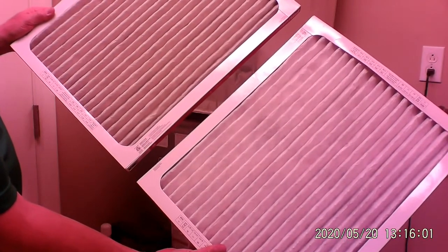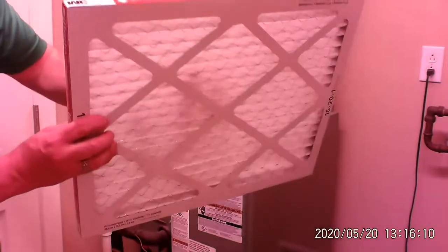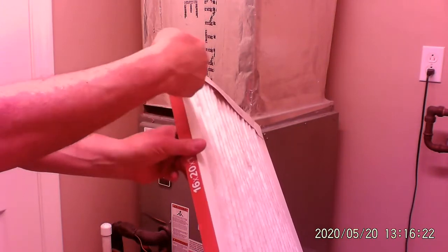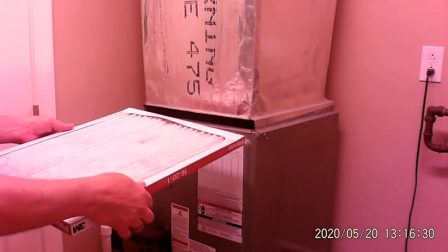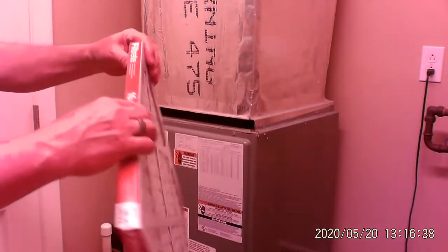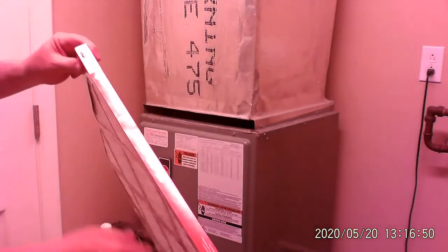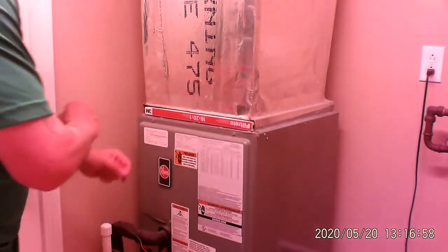It's furnace filter time to change it. Now, which way do you put it in? Well, if my air is going down like this, I want it to go through this part of it. This little cage here catches it so it doesn't force the filter through. It also has an arrow right here on the side that shows the airflow direction. So the airflow direction goes down my flue here, through the filter, and then into the motor itself. What size should I put in? That's listed right here on the side. Mine is 16 by 20 by one — 16 inches this way, 20 inches this way, and one inch thick. So I'm going to follow the instructions — airflow goes down — and I put it in. It slides right in just like that. And that's all there is to it.